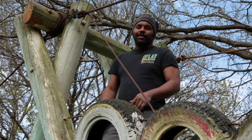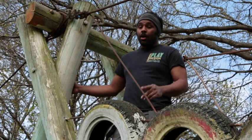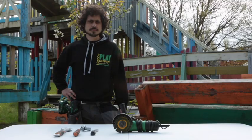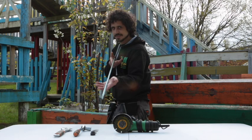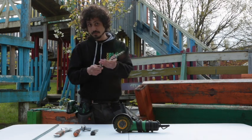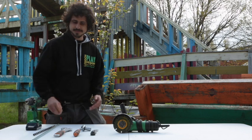Welcome to the third part of our video where we're going to talk to you about studding. Studding is one of the strongest ways to make a connection between two pieces of wood. However, this does involve using a grinder and if you don't have experience, we recommend you ask us. When you come to do your studding, some of the tools you'll need are a grinder, a drill bit and a drill, some nuts, washers and caps, and a spanner and ratchet.